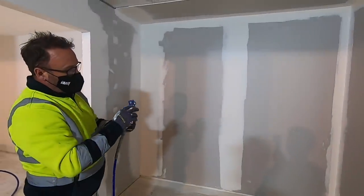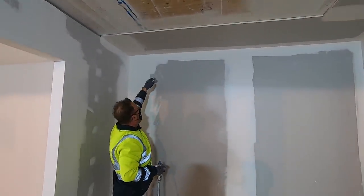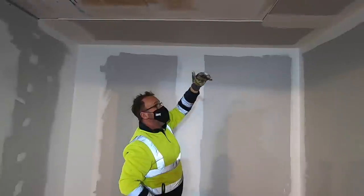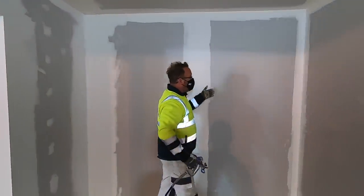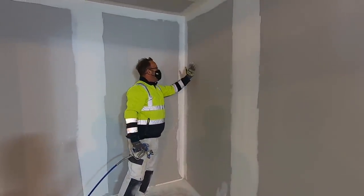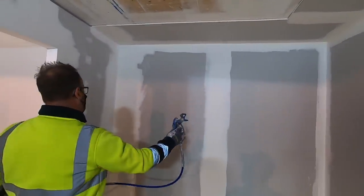Machines are primed and ready to go — safety's on on the gun. What we normally do is we do the ceiling first. We overlap each pass by 50% and come down three to four hundred millimeters. That way when we go back to do the wall we're not going back into a wet corner. We do that all the way around the whole ceiling. Then we do the wall — 50% overlap the same. When we run into the corner we bring it around, come back to the corners normally within about 30 minutes with a twitcher, let it stiffen up, tweak the corners. When you come back to the wall all you're doing is going back up and working across — you're not going back into the wet corner because you've already done that.